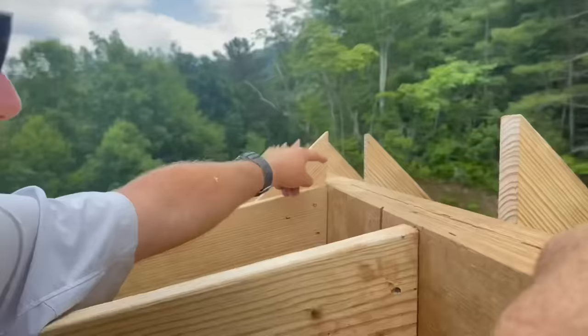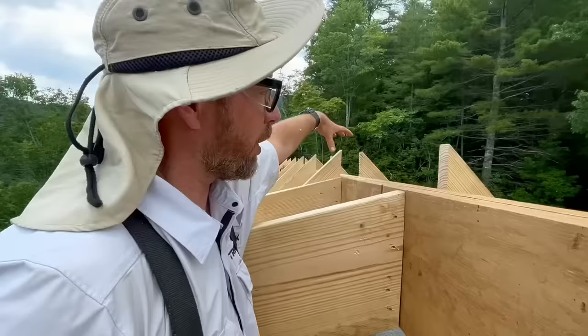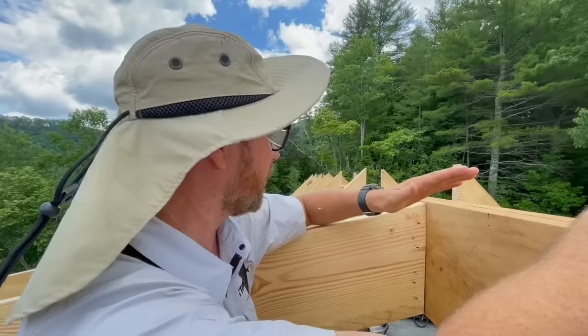One thing we're doing is letting these lower pitch rafters come in lower than these 12/12 rafters — about four inches difference — and that's on purpose so that this ridge cap shingle won't get into this lower pitch roof and have to make some weird transition from a steep pitch onto this shallow pitch. We did that one time and it did not work well, so from then on out we started letting our shed dormer rafters come in lower.